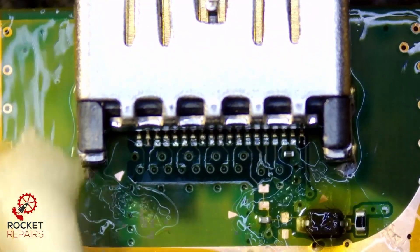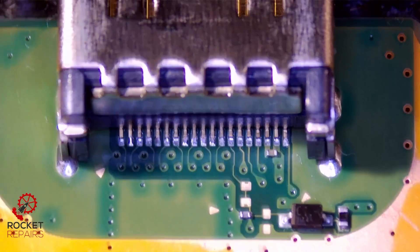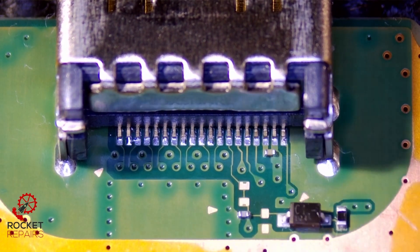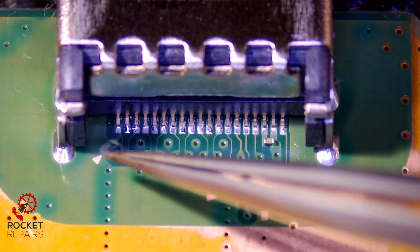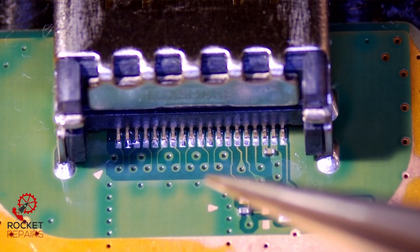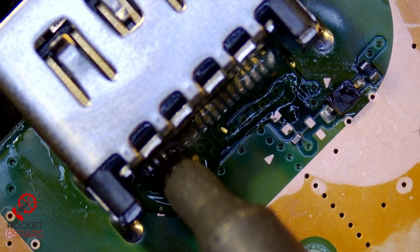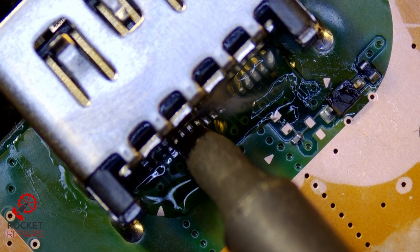Here we have the results of the drop method. Going to heat this area up again a little bit because of the flux. Now looking at this you might be thinking it doesn't look like they're soldered to the board, but if I take my tweezers and just give them all a quick nudge, you can see that every single one is solid. This is the reason why I flow ports into place — look at the anchoring points on the ground legs. I'm going to go over these pins just because I want them to have a nice finish. I should just be able to use the solder on the pads — just add some more flux and gently touch the pads with the pins.